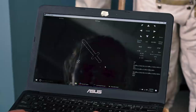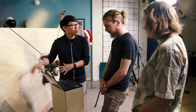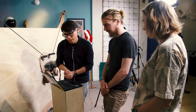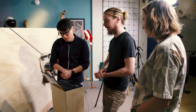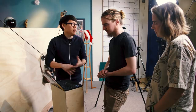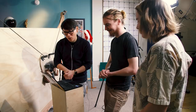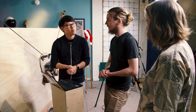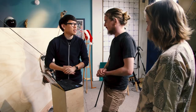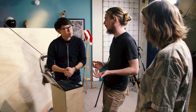Within Ground Control software, you can move where your start position is. This image right here is what the system knows about your board — and that was all pre-calibrated. That's why we do a calibration step, so it knows where it is, and it remembers that between powering on and off, so you really only have to do it one time when you set up the machine. You can use one sheet and just cut as many things as possible to maximize that sheet. The system doesn't currently retain information of past cuts, but that's kind of on our to-do list — it would be nice to have a dropdown of all your sheets. All of our software, firmware, and hardware is completely open source, so a lot of our features are things that have been added by the community because someone wanted it, made it, and then everyone gets to benefit.